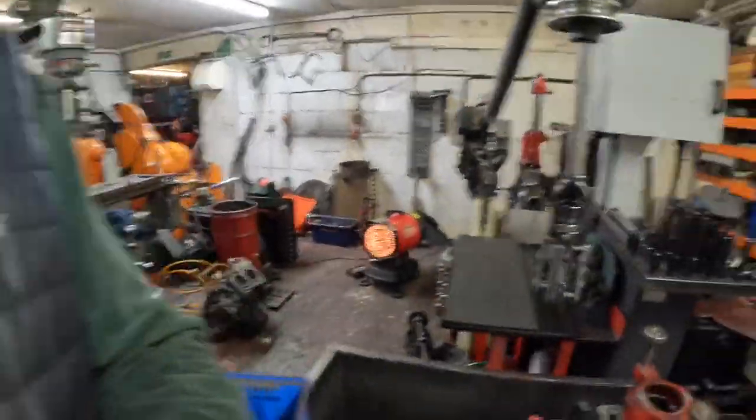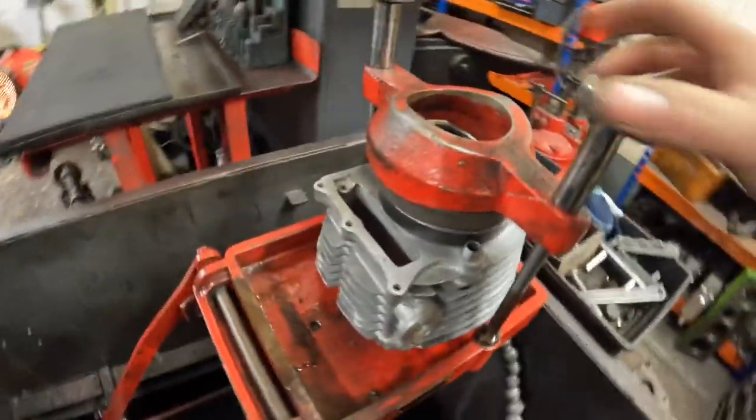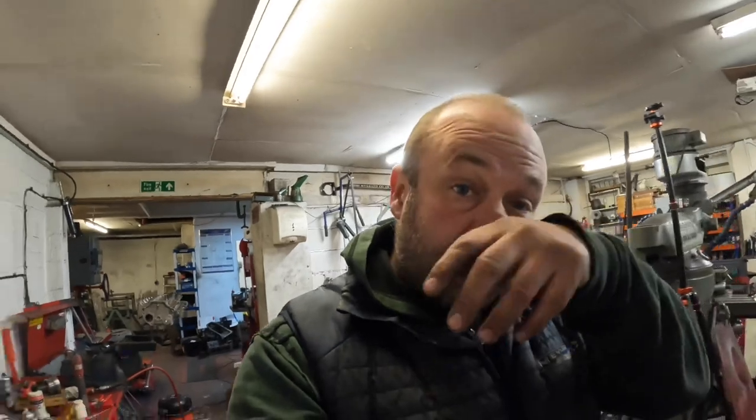So it's Tuesday today, and we're on a bit of a motorbike roll. We did the Harleys a couple of days ago, and now I'm doing this one, I think it's an XT, like a classic motocross bike. I had to remove the head studs out of it, which took forever. I had to get the barrel really hot and then try to extract them, and no grips would hold them. I'll show you the stud actually. They're the studs, but I couldn't get any grips to grab hold of the stud strong enough. Even the proper stud extractors wouldn't hold it strong enough. It just kept slipping.